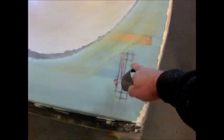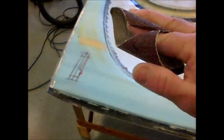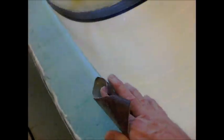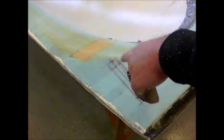Today I'm contouring the inside of my canopy. I've marked where my forward hinge canopy hard points will be. I'm just contouring using whatever works - right now I'm using my finger and a rolled-up piece of 80-grit sandpaper. I can slide my hand over it and feel the ridges I'm sanding. I'm going to leave these hard points level and not touch those - I'll dig them out later. I want to contour everything first.